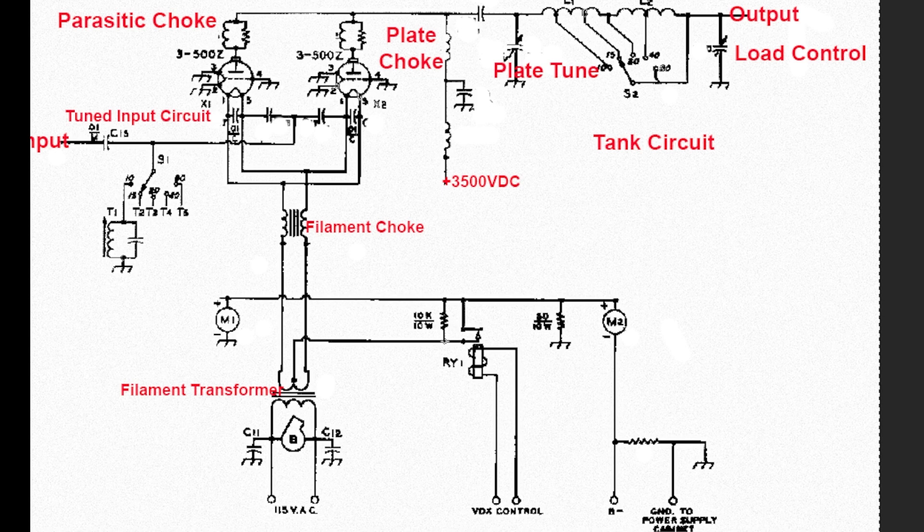The metering is done in a really clever way in the low-voltage leads. Instead of having the plate current meter in the high-voltage lead, we can put it in the lead which is just slightly above ground. That means the plate current meter is just a few volts above ground but it's reading the current. There's also the all-important grid current meter. Those are the stripped-down parts and pieces of a linear amplifier.